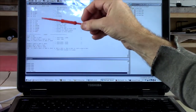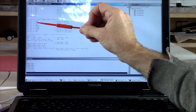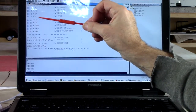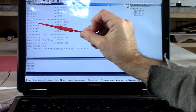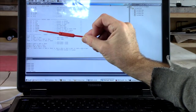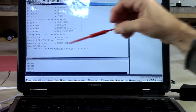The output pins, pin 19 is ROM, and okay, so these are active low except for this last one, which is active high. There's a little exclamation mark there, which you may or may not be able to see. ROM, I/O, RAM, read RAM, write RAM, chip enable RAM, and read. So, that sounds a little weird. What's going on with RAM versus CE RAM?